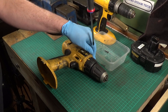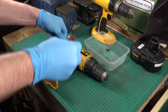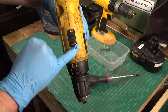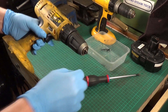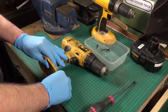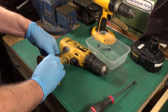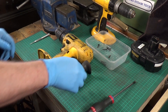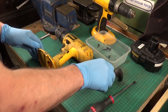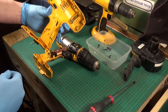There are parts of the switch visibly broken from the top, so it's probably not actually switching anything. We'll have a look when we get it apart. As far as I know, you don't have to take the chuck off — you just take the screws out and it should come apart. The grip's got to come off too — it has little clips on it and if you're gentle you can prize it and it'll just pull off.